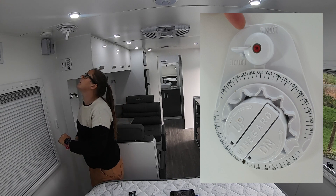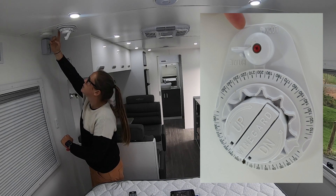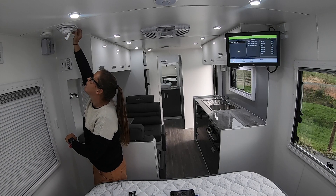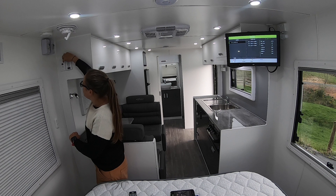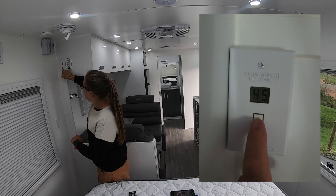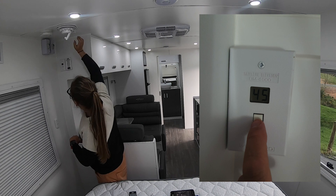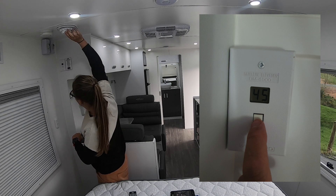There's a little arrow on the internal dial and you want to aim that at about 300. So just go somewhere near 300, flick it back to lock, and then check your elevation again because sometimes it moves — it popped back up to about 46 so just wind it down again.